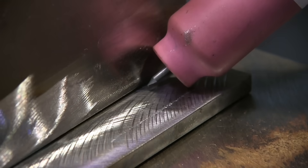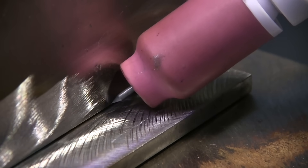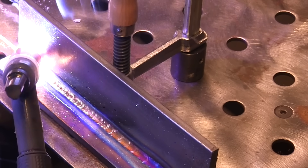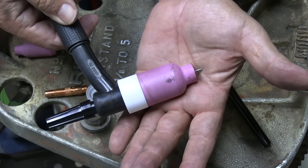That's one pass — we'll let it cool just a little bit. It's like doing this on a regular T-joint. If you want to get some practice, just set up a T-joint like this. You may have to set it toward the edge of the table, because walking the cup works better on round stuff. If you put it on the edge of the table, you can get your settings dialed in and get some practice just on a regular T-joint.